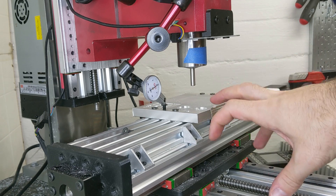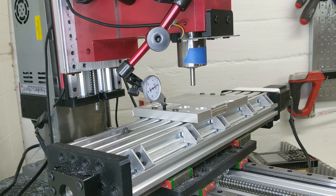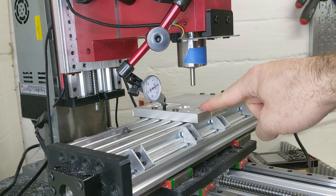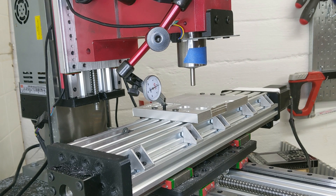With this whole coupling, I should be paying attention to cut forces and making sure they're sufficiently low. Basically, if I try to take a cut with 10 pounds of cutting force, this thing is going to move seven thousandths, which is bad when taking a deep cut. Spring force tends to be linear, and I'll probably plot this on a graph. The more interesting test will be once I swap these out for aluminum and compare the cut results — to see if aluminum is that much better, or if plastic is good enough, and to understand how rigid a 3D-printed mill can get. That's it for now, thanks for watching.